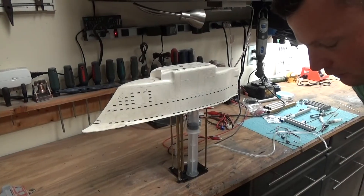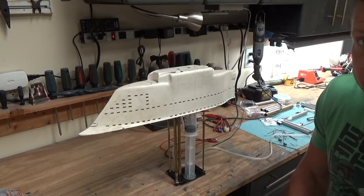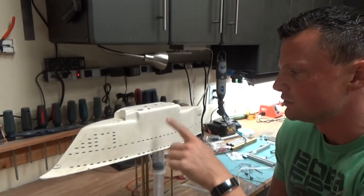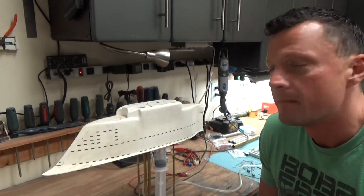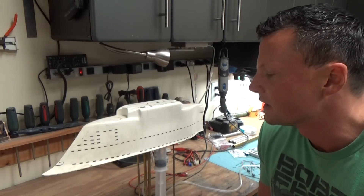Let's take a look at the inner workings of the periscope system. This particular iteration took me quite a few tries. Originally I wanted a hydraulic system based on a series of individual syringes, but unfortunately they only traveled about three inches. I wanted more travel than that because this is a big model — I want to be able to raise it to help maintain periscope depth during operation.